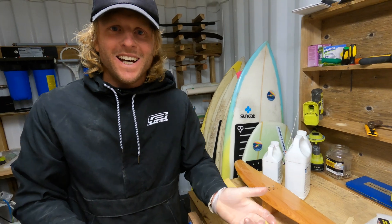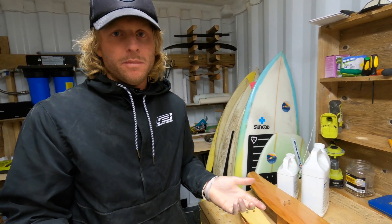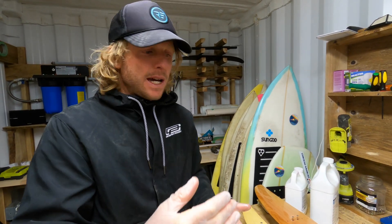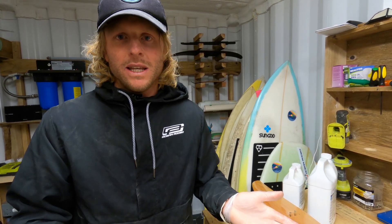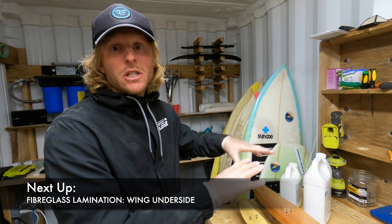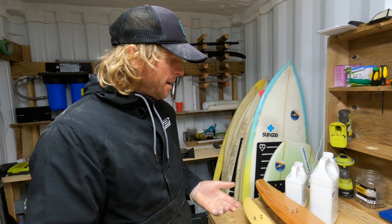Okay, so they look great. That's done for the day. Leave it 24 hours in between processes. Something about building this foil is that from this point on — I mean that was sort of the hardest work — there are lots of individual processes day after day: we'll laminate the bottom, do some fillers, laminate the top, hot coat the bottom, hot coat the top. It takes multiple days but it's only an hour or two a day. What's great is that's the shape now — we're not going to change it. All we're going to do is reinforce it with the carbon and fiberglass layup. Thanks for watching and we'll see you in the next video.